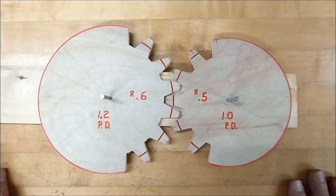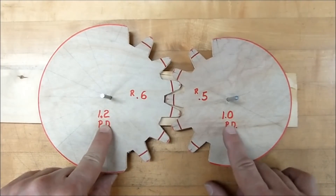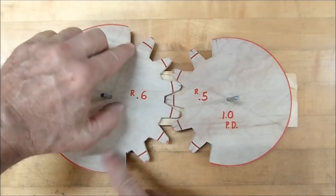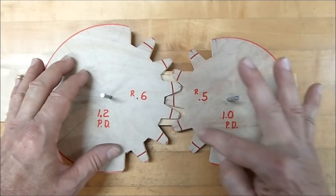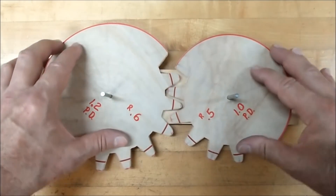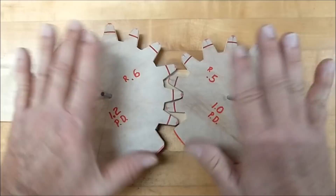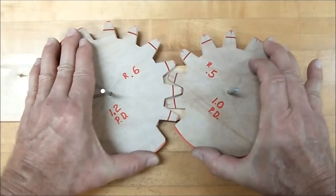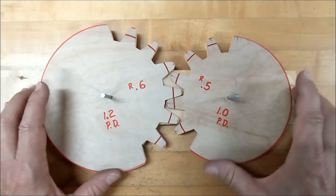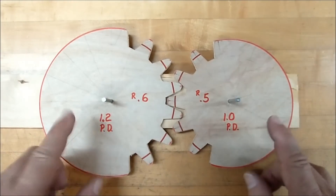Let's take a look at the wooden mock-up I made to explain what I'm trying to convey. Every gear will have a thing called a pitch diameter — just like every screw has a pitch diameter. It's not the same as the OD; it is a mechanical theoretical line between the teeth. In an ideal world, those pitch diameters will run tangent as the gears move — they will never overlap. If they overlap, it's going to bind; if there's too much space, the teeth jump around and make noise. I'm not going to get into pressure angles and lead angles — this is simply: I have two gears and I want them to mesh — how do I do it?